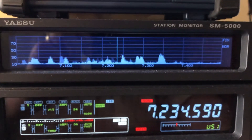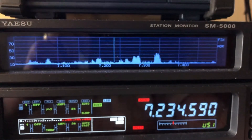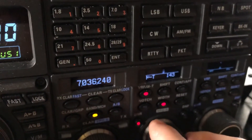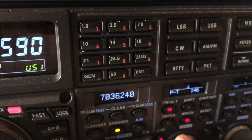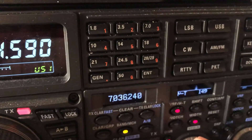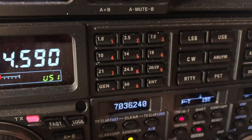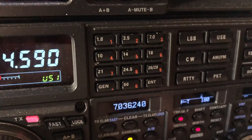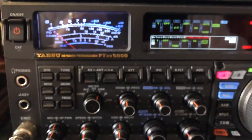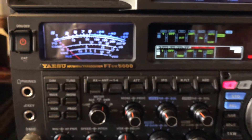You're just engaging a pre-selector, tightening the front end. I like to use it for noise reduction. When you engage it, it's got settings here — you may hear it clicking, the motor running in it, a little stepper motor. You can intentionally move away and the noise floor drops, but you still hear the person you're listening to. I hope you found that informative — I just had that quick opportunity there to use those features in a practical application.